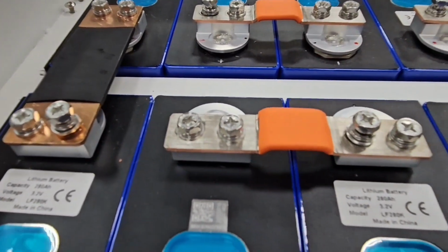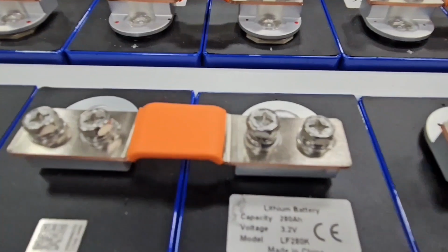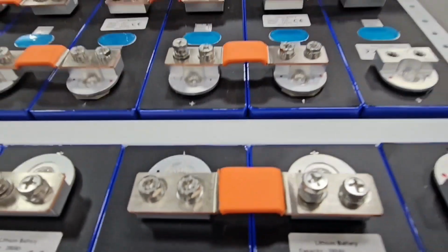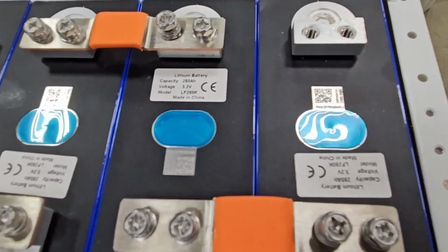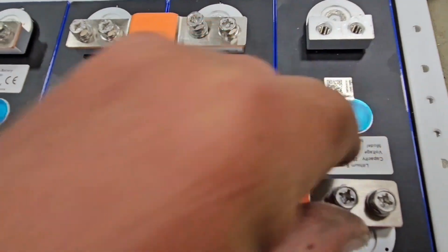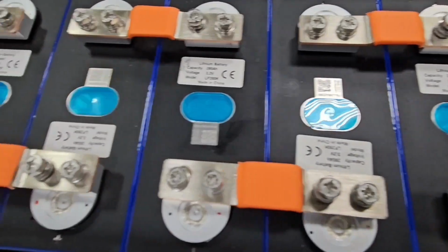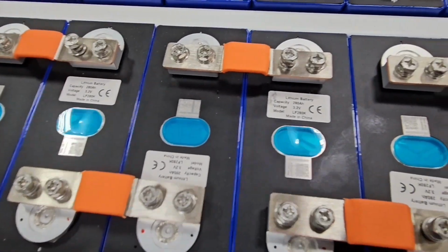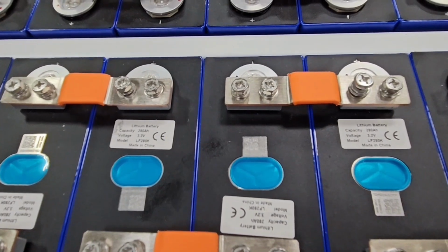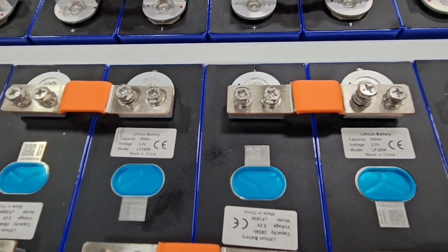So I got them all trimmed and put on there, and as you can see, there ain't no heat shrink going to be sandwiched in between the battery terminal and the bus bar. Now, on every positive that's going to get a balanced lead here, I've left those screws loose, so the rest of them are all snugged down and ready to go. So we're going to get the BMS on and then start running balance leads.